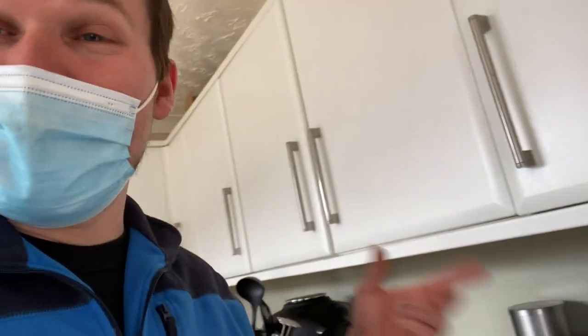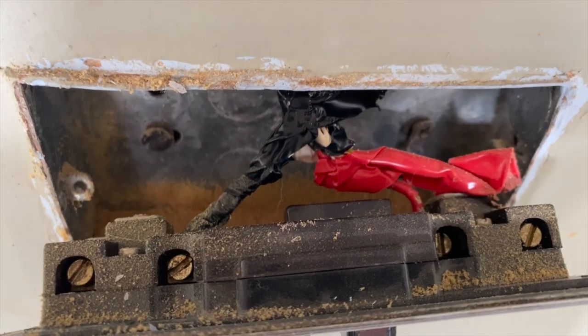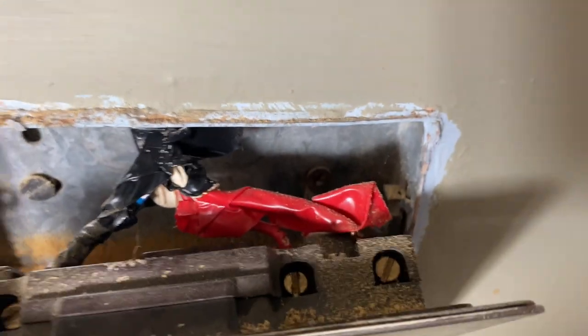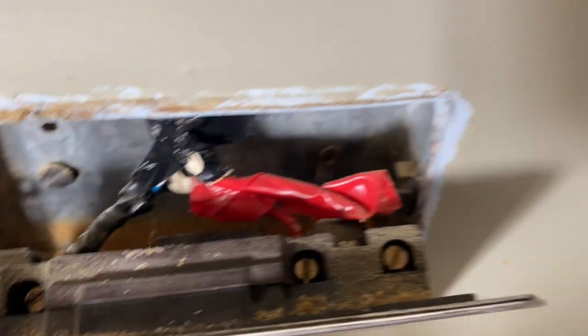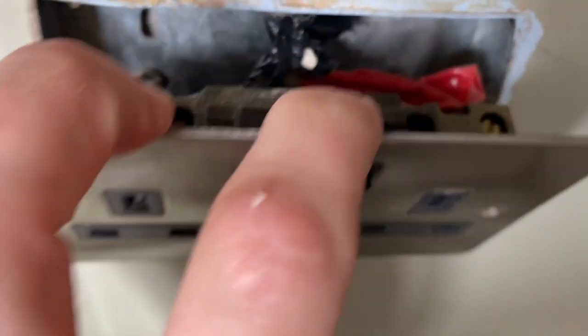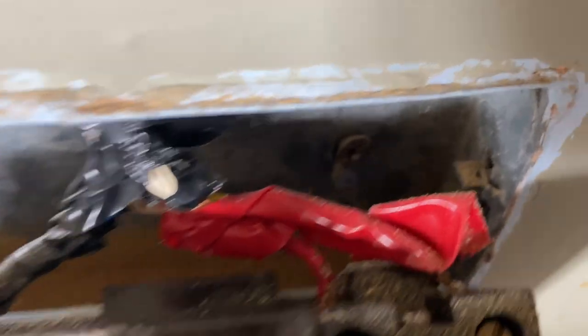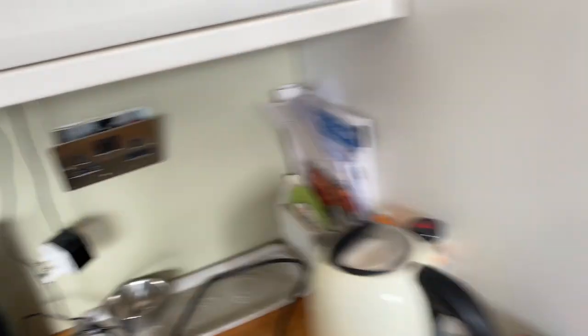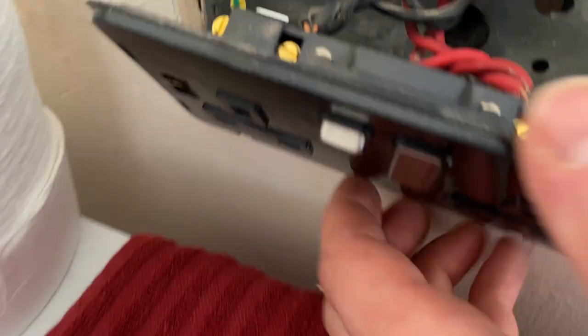As the board is completely rammed and I can't identify where the CPCs are, I'm going to do some end-to-end readings at the socket - it's the only way I can get some readings. But I'm not confident we're going to get any anyway. Metal socket. Oh, one mil cable it looks like to me - I'm going to have to undo this. Look at it. I don't know what they've done here. Same room and this one has been on a roller coaster.